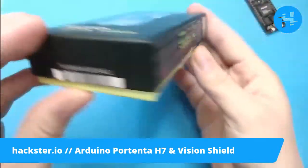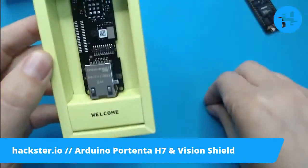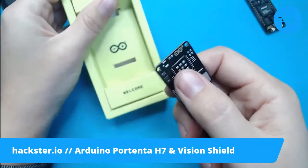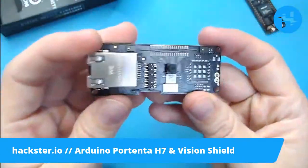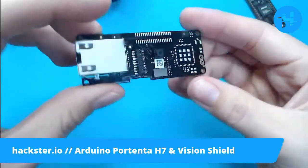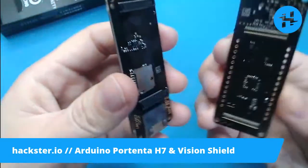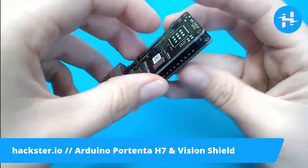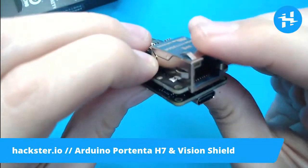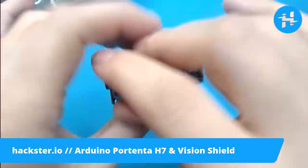Let's show you the whole thing again — another beautiful stamped foil authenticity hologram. I'm such a sucker for holograms; I used to make them in college, though a different type. You'll see right off the bat there's an unpopulated area where your LoRa chip goes if you're using that variant — but this one has Ethernet. You've got your little camera, your two MEMS microphones with beamforming capability, the HD connectors, and the SD card connector. Let's put these two together — they've got to go this way. That's very satisfying — just a slight click — and they go together very smoothly. There you have your full Portenta H7 and Portenta Vision Shield assembly.